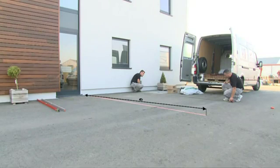It is also very important to think of the flow of water. Therefore, we recommend providing a slope of 2 to 3% if your support is not self-draining. Do not install your Softline garden deck on a furnished ground.